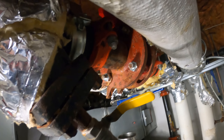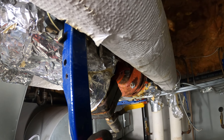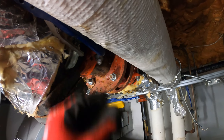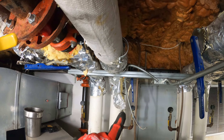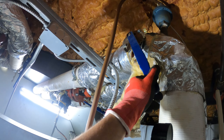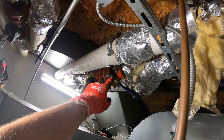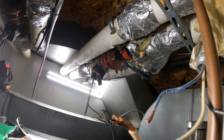Let's close this drain and open up the water. Let's see if we have any leaks — pray to the Lord there are none. Here's the supply valve right here, so let's just crack it open. That's open. I don't see any leaks. Let's open up the other valves. This one is the bypass that stays closed, and I've got to open up that valve to return. So we're only testing one side — at least that side is not leaking. For this side we actually have to open the valve for it to send water through to know for sure. But so far, so good.